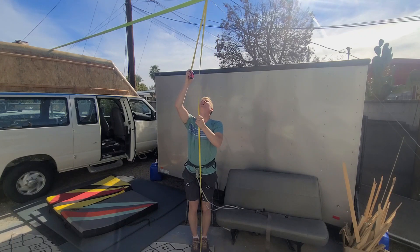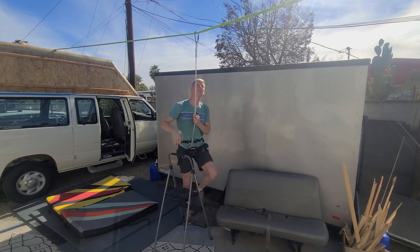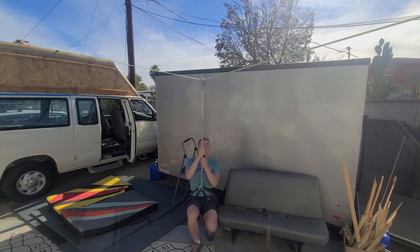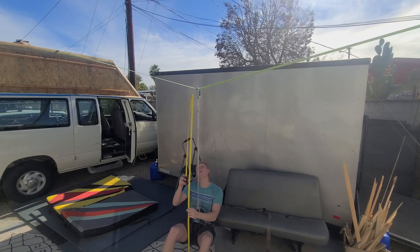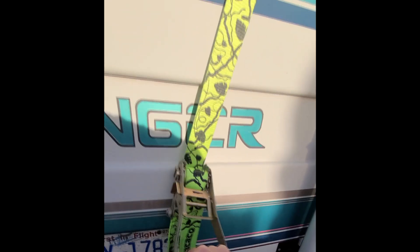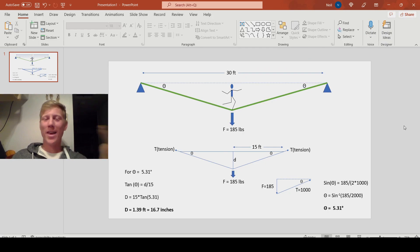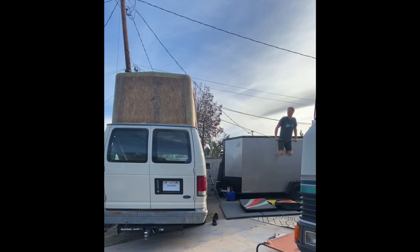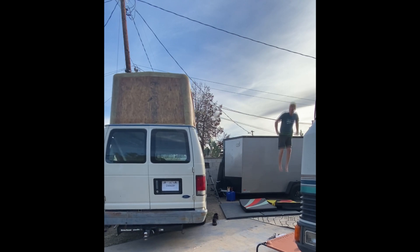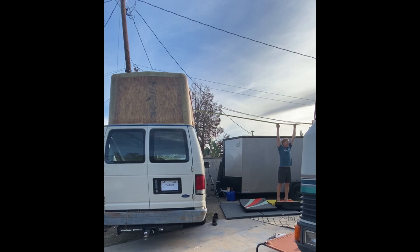Now it's time to get to business. Our goal was a 17 inch deflection in the center, but in reality, with the flex of the line and the sway of the van, I was a lot closer to 30 inches than 17. After tightening the line as much as I possibly could, the best I could achieve was a 24 inch deflection in the center. Plugging this back into our equations gives us a 700 pound load in the slackline at a 7.6 degree angle. That's the static load case — factoring in the dynamic load from my body weight bouncing on the line, I think we're well over the thousand pound mark.